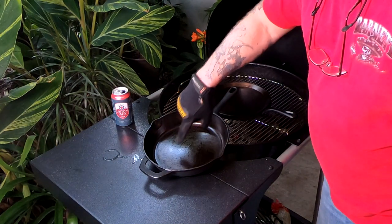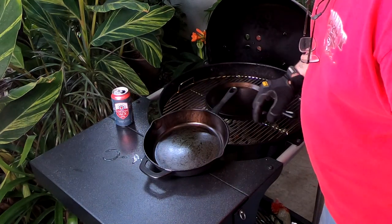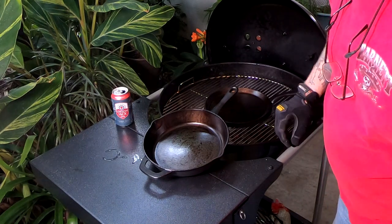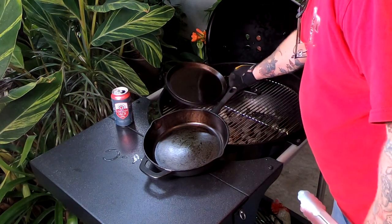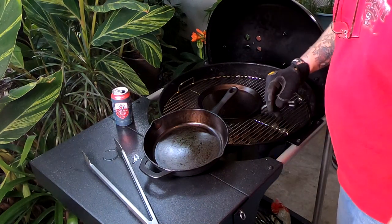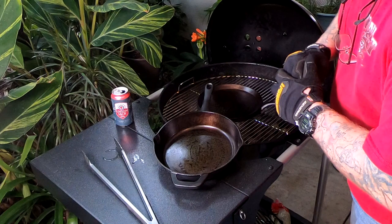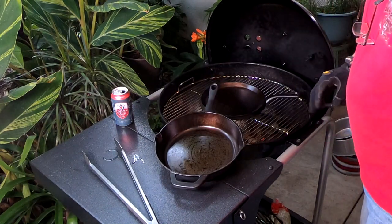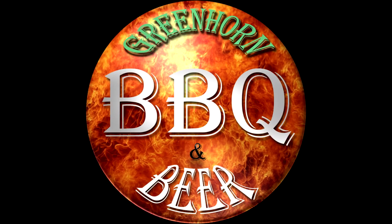I'm not sure what's causing all these striations — it's kind of a runny, globby look. I did a second layer of olive oil with a cotton rag this time, but I think it's fine and acceptable. I think over time it's going to season just fine and we've got the non-stick coating on there. If you have any comments or know what caused this, let me know down below. Any suggestions — maybe something I did wrong — this is the first time I've ever ground a cast-iron skillet smooth. Let me know what you think, and of course like and subscribe if you want to see more.